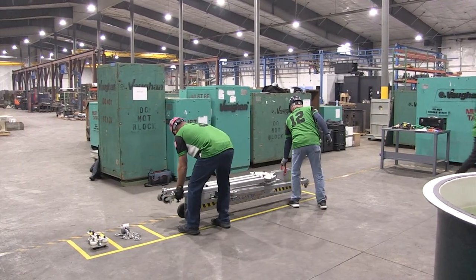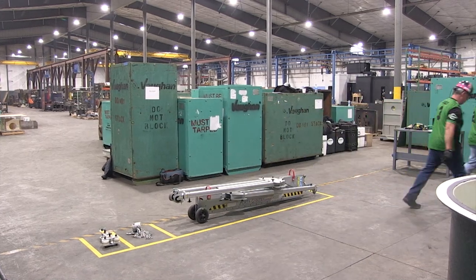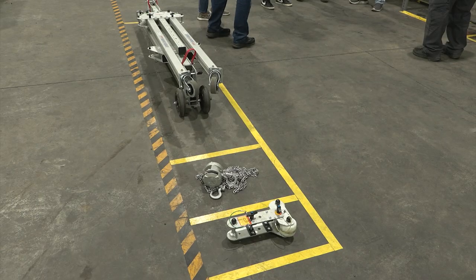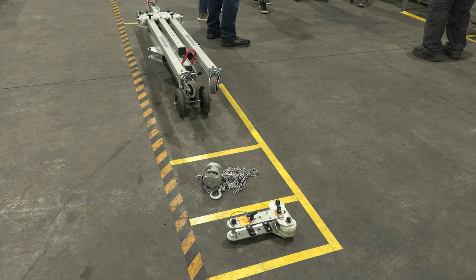The wheels must be facing the opposite of the setup table. Reinstall all pins in the gantry and trolley — pins shall be inserted on the same side as they are attached to the gantry and trolley. Place the trolley and chain hoist within the marked areas — touching the tape marks or going over the tape marks is not acceptable.